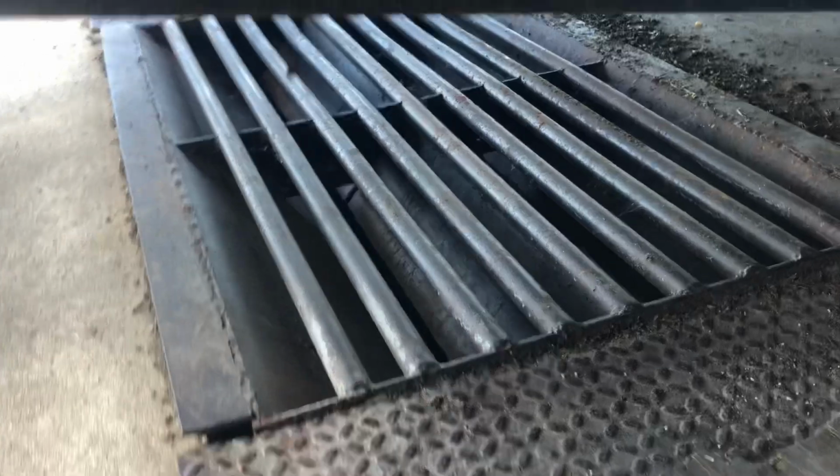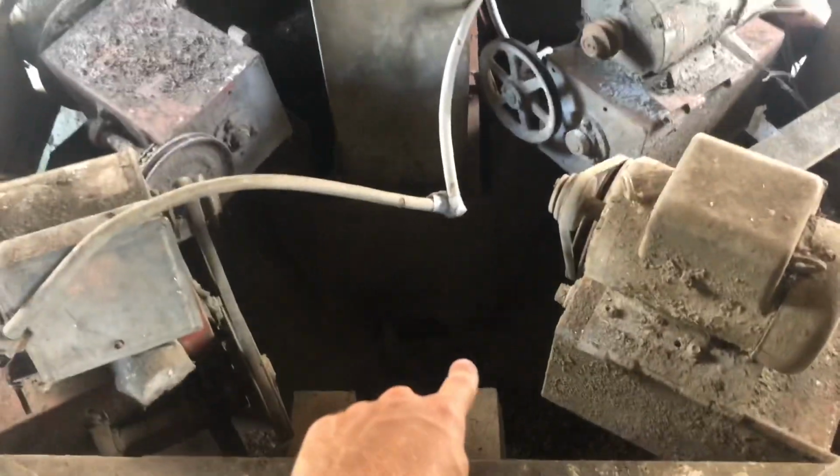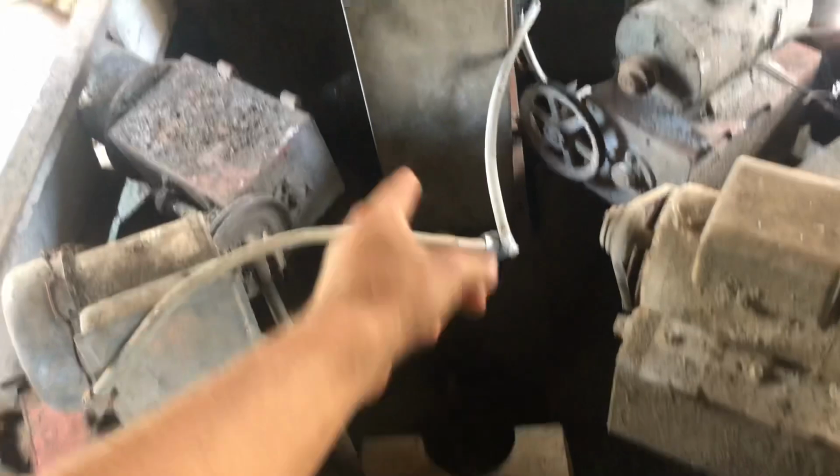So there's no pit. It's just got a cross auger, and that auger runs down to the leg, which has a little pit here and a slide gate, so you don't overload the leg. It's got 4 10,000 bushel bins that all tie in to that same pit to reclaim it. There is a dryer in here, but it does not work. But 4 10,000 bushel bins and a leg, so it's better than nothing.